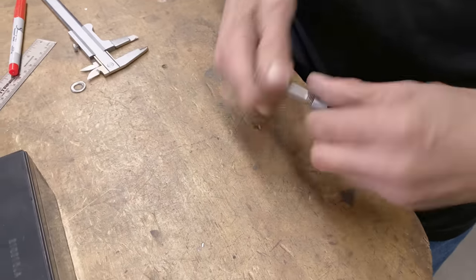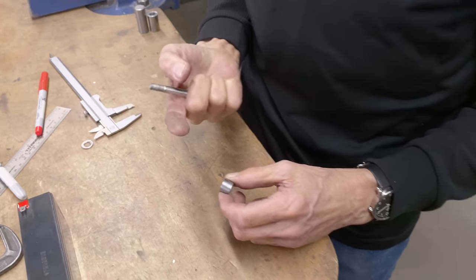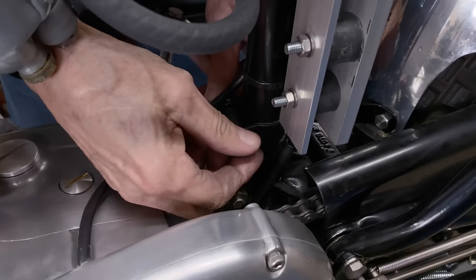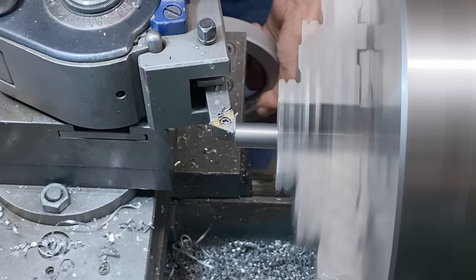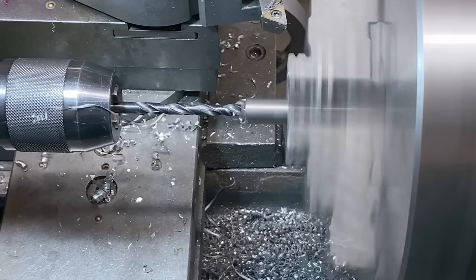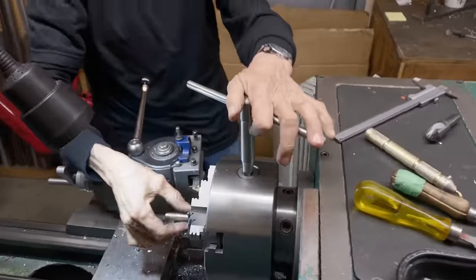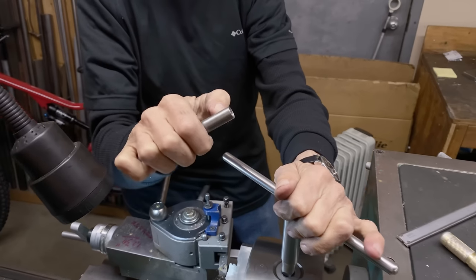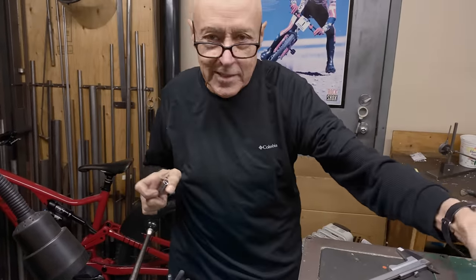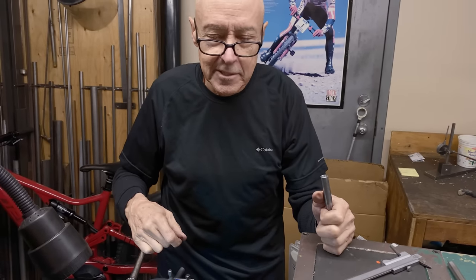Hitting the loctite now. We'll put this on — this is the first piece for the stabilizer. We're calling this little piece on the bottom the stabilizer. This has to join up to here somewhere. What I did here is I counterbored it because we're going to put an Allen screw right down inside of there so the head of the Allen screw will be hidden. Now we cut this off and take a piece of 3/16 rod, bend it, and do some TIG welding. There's a lot of stuff going on.